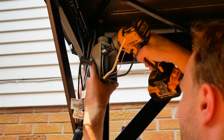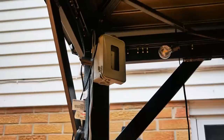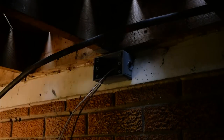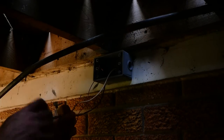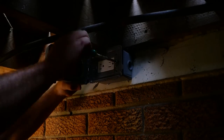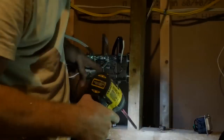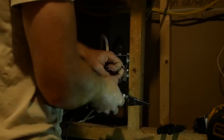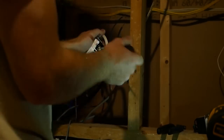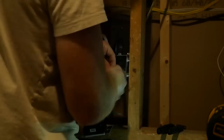To power all of this up, I put a box up in the top corner just to kind of hide it. I put in a regular plug because it's GFI protected from the inside, and put on weatherproof covers. This one here is for the barbecue lights as well as the deck lights. To control all of the lighting, I put in a three-gang box. The first device is a GFI, which feeds the two switches. I put in smart switches — specifically Lutron Casetas — as it allows you to control the lighting from your phone and also create time settings. I originally had dimmers because it's what I had on me, although I changed them to the non-dimmable variety later because you don't really want to dim your plugs.